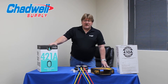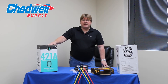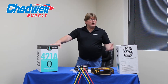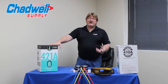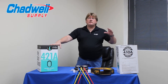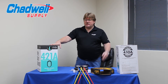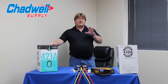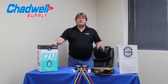What I mean by drop-in: you remove your old existing charge of R22, handle it carefully, put it in your recovery cylinder, and use that recovered R22 on different units throughout your property so you can reuse that refrigerant. If you've decided to retrofit or change over a system to one of the other drop-ins, remove it all, run a vacuum, change your valve stems, and you may want to consider changing the dryer if you open the system.